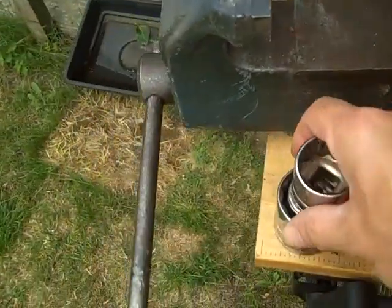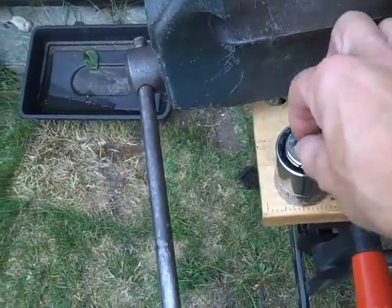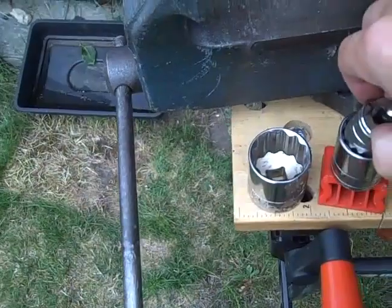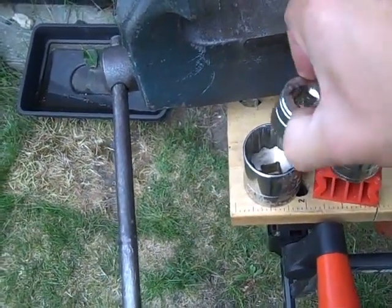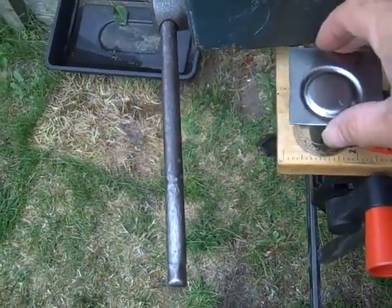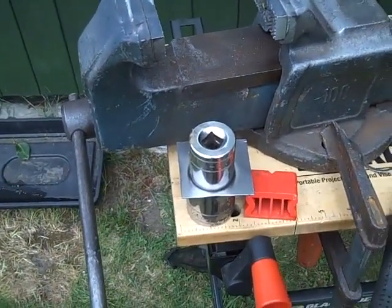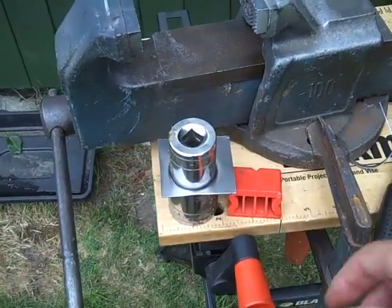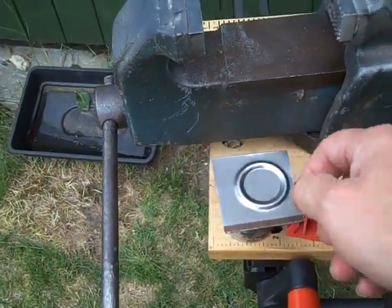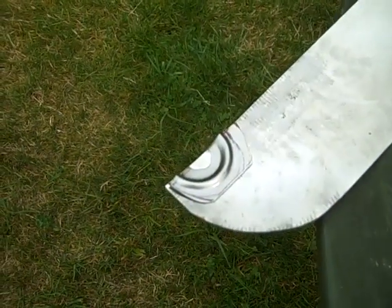You need three sockets and each one fits inside the other — this one fits inside this one, this one fits inside here and also inside here. When you put them together and clamp it in a vise — obviously starting with a flat sheet — as you do it up, that impression is left. All we need to do now is cut that in half, trim around the edges, and hopefully that will be all we need.